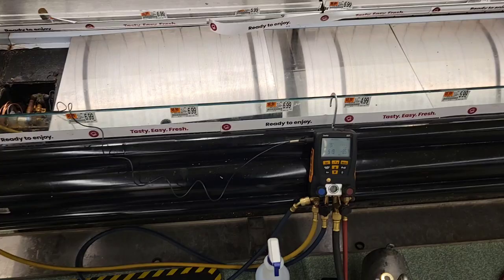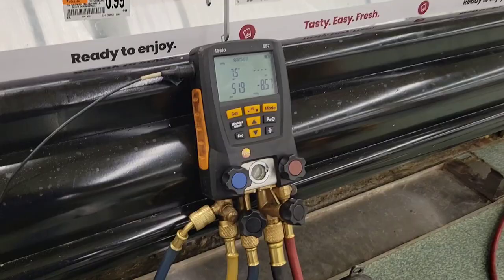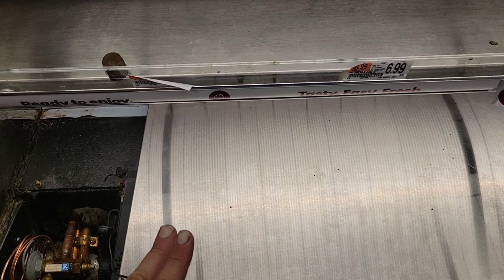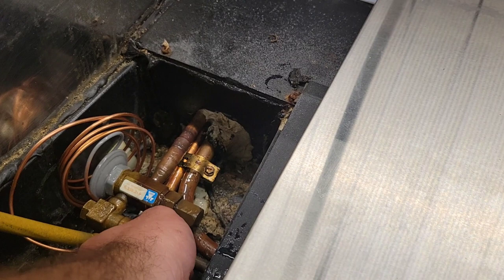The superheat is now down to 7.5 - you can see that value right there. It's at temperature and holding at 7.5. Realistically, what are we going to gain from dropping the superheat another 2 degrees? Yeah, it might make the refrigerant a little cooler going back to the compressors, which would be good. But sometimes these things are so finicky. It's holding within 7, which is within 2 degrees of target, so I'm just going to leave it. The case is pulling temp, everything's working fine. I hope you learned something today - let me know in the comments if you have any knowledge you want to share. Please like, subscribe, and that's how you do it.